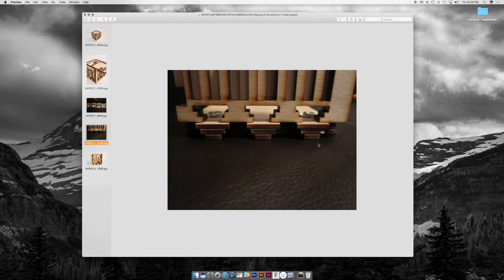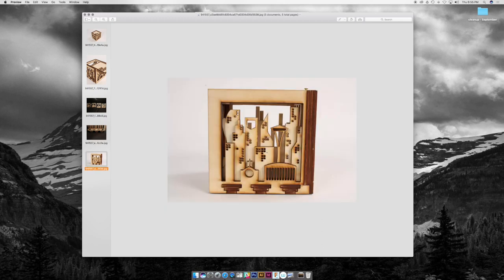The goal is that when you have different layers that you're stacking to laser cut, you can get more dimensionality in terms of how parts interact, assemble, and fit together. You can have things like mortise and tenon joints that are hidden and fit in beside other parts, or stepped dovetail joints that you normally couldn't do with a laser cutter with just one layer, since you can only cut in one direction. All of it pieces together to make a finished box. We're going to cover the specific joints we're going through.